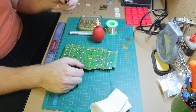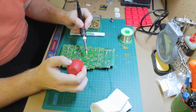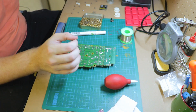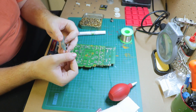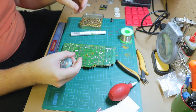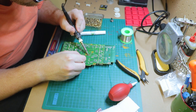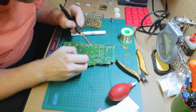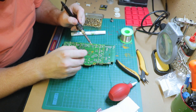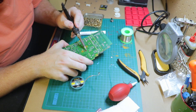Then make sure it's nice and clean, get the new part to fit nice and neat, make sure it's straight, and then we'll solder that in. The solder sucker removes the bulk of it, then I'll use wick — which draws out any remaining solder. If it's too hot it'll draw up the contacts, which we don't want, so less heat is more, but we do need to melt it. Be careful — the iron is hot. Now we should be able to push these pins through.